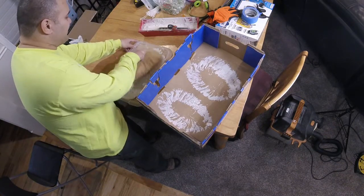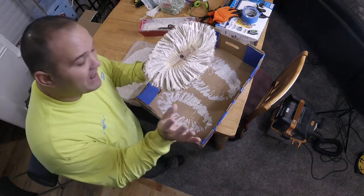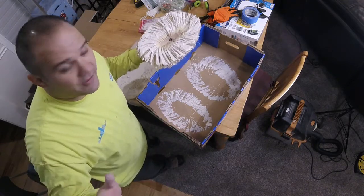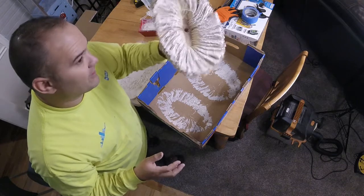You're going to want to look at your ceiling and look at the style they used. Did they go in perfect rows? Is it a tight pattern or a really spread out pattern? On this one there's no pattern — they just stamped all over the place, twisting it every which way, which kind of makes patching a little easier because I can just go all the way around.